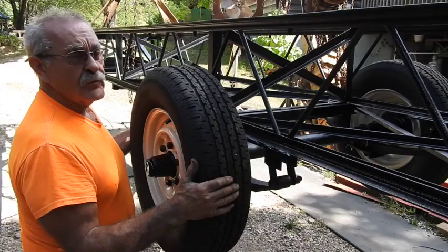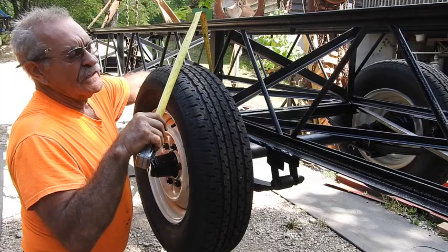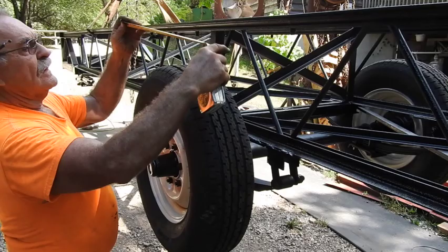So I'm going to show you the highly technical way I approach something like this. What I'm going to do is just kind of look and see what the height is. I've got roughly eight inches in height to the top of the tire. You'll want to figure there's going to be a little bit of travel, so the back of it would be 10 inches tall — that'll give two inches of travel. Looking at the diameter of the tire, roughly 18 inches is going to be needed to go from there to there on the tire.